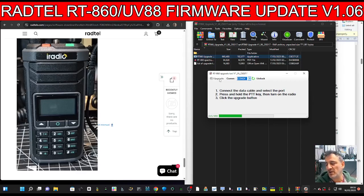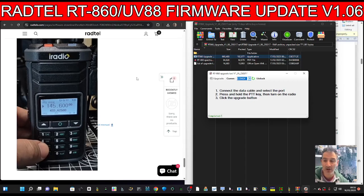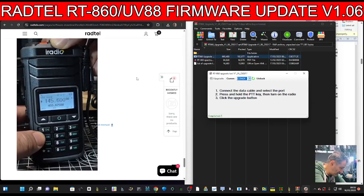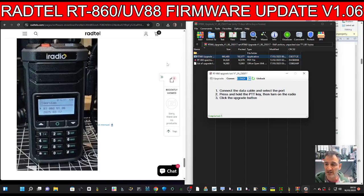It's not really big changes, but at least we've done the firmware. Fast forward, then to see your version, go to Menu, down one to Basic Set, hit the circle button, then go up until it says 'Version' — it should show 1.06. They're fantastic radios: connect your HF antenna and the HF comes through clear, VHF, UHF — it's just a no-brainer. The firmware date is the 18th of March 2025.